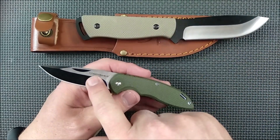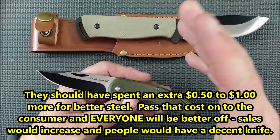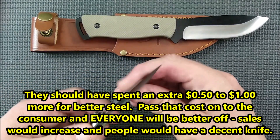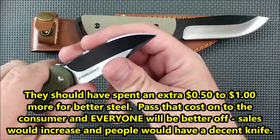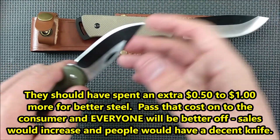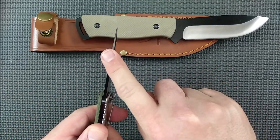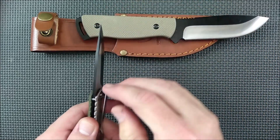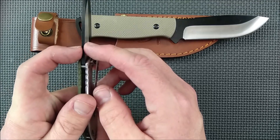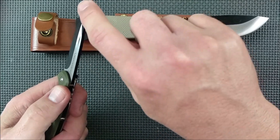And this is better than nothing. The 440 Rockwell hardness goes to around 58 — it's probably more commonly 57 under most manufacturers, and that's not a slouch. That's not a bad hardness for a knife edge. It's not super durable, but it's not crazy hard to sharpen either, so there's that trade-off for that steel. The thickness of this blade is 2.74 millimeters, which is 0.108 inches — well under an eighth of an inch, but not too much under. For the size of the blade, it's not bad at all.